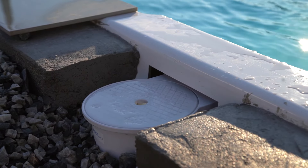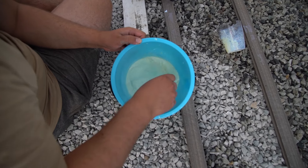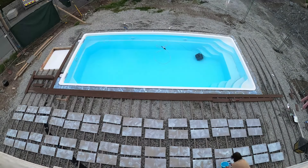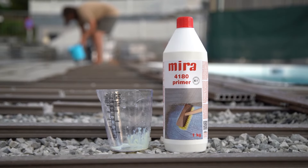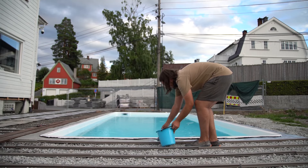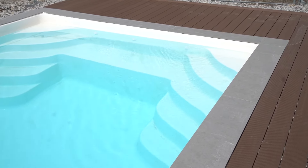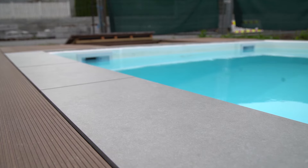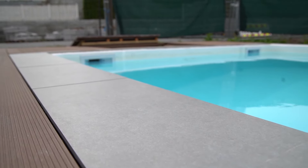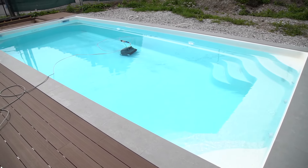After consulting with a construction engineer, we decided to attach the tiles this year after all. The day before attaching, we made sure to prime each piece — if you spill to the visible side it is easy to peel off. Don't forget to soak the concrete with primer as well. The tiles were cut and designed to fit the frame of the pool. If you look closely, you can see it angles slightly upwards when getting closer to the water — this is done purposely for drainage.